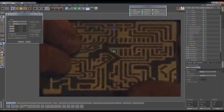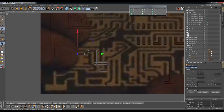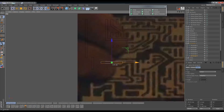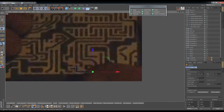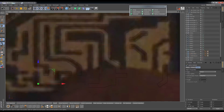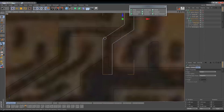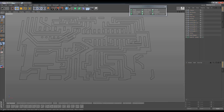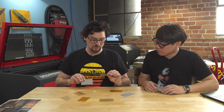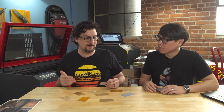What I did is use the screen grabs to draw everything out in vector form. It took me like two days because there's no shot of the whole thing — you have to piece together certain corners from different shots. I think I got it pretty accurate; it's just trial and error in your vector drawing program — Inkscape, Illustrator, I actually drew it right in Cinema 4D, which is a 3D modeler but you can totally do vectors in it. I exported it into Illustrator and colored any areas that would be burned off with raster etching in black, so the gold or shiny parts stay and the silver parts are the etched-off areas.